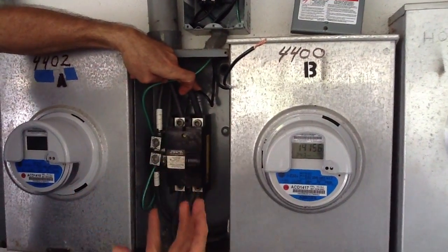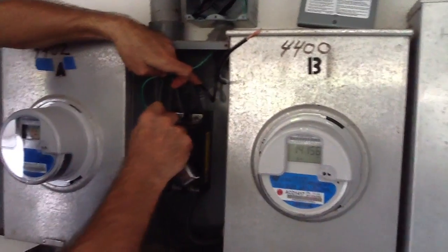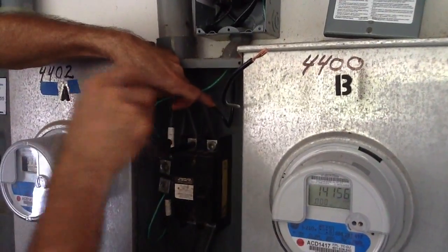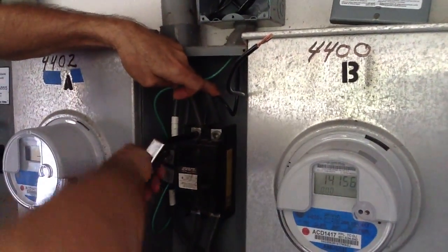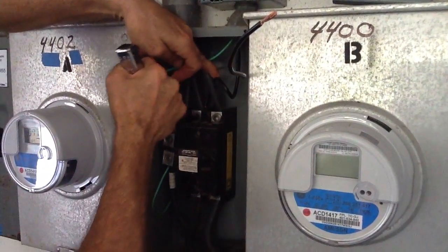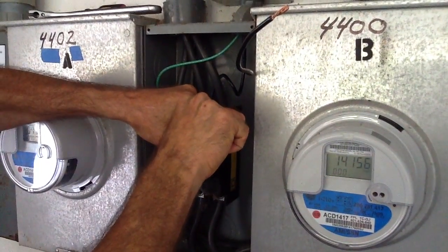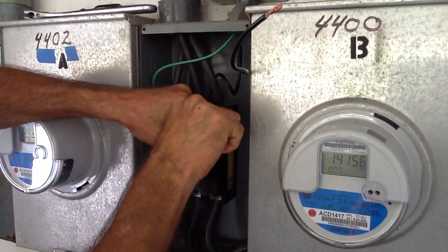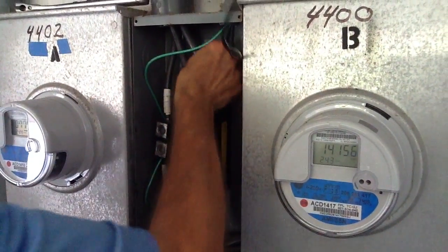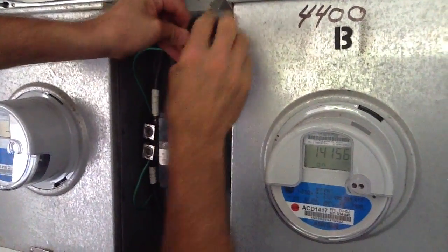This already has what they call deox — it's a deoxidization solution that you can use with copper and aluminum together. It's not recommended, but sometimes you have no choice. I'm keeping some force down as I tighten this up. You don't want to over-tighten these lugs — you're really supposed to torque them down to a certain torque value. For real electricians you might want a torque wrench, though I don't know anybody who's ever bought one. When I'm finished I'll tug on that wire to make sure it has locked in. I'm just snugging it, not over-tightening.